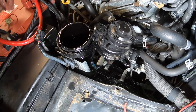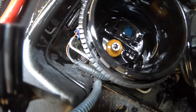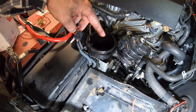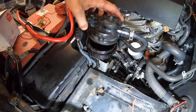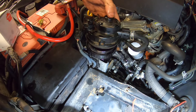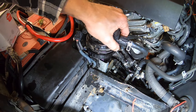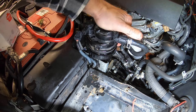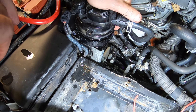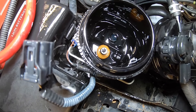You can see it all drained out of there. Now I can check inside that canister for any filth or dirt — this one looks pretty good. There's not much rubbish inside this canister, but I do want to give it a little flush out while that plug is out. How I do that is with some fresh diesel, which comes out of this pump. Just put it back on just a little bit and give it a pump — you'll see new diesel coming out of that hole at the bottom, and that just cleans out the canister. That's how I like to do it, and now I know that canister is nice and clean.